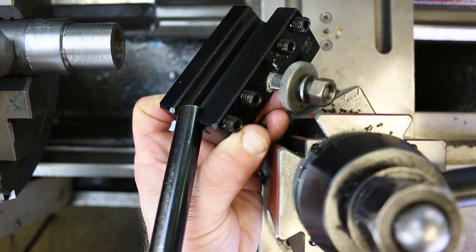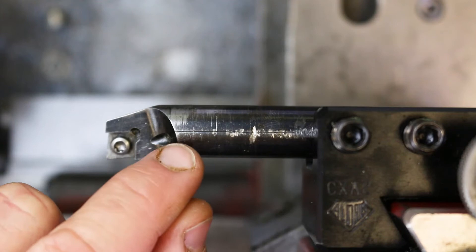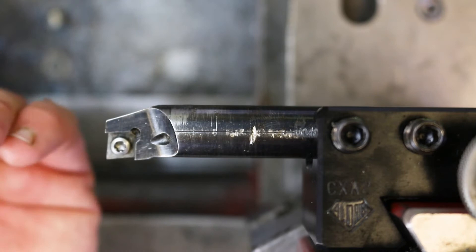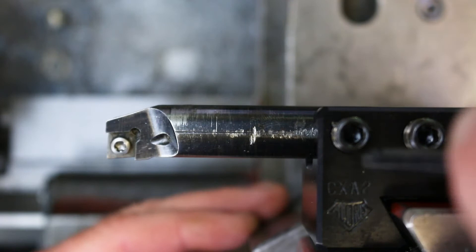The depth of our hole is going to be about two inches, so we give ourselves a little safety margin — maybe stick it out two and a quarter inches. There's a scribe line in the top of the boring bar specifically so we can line it up with the set screws. That scribe line tells you where the top dead center position of the boring bar should be when the insert is in the correct orientation. We align the scribe line with the set screws to get the correct orientation, and that looks pretty good, so I'm going to lock that down.